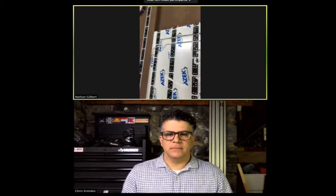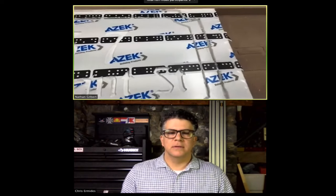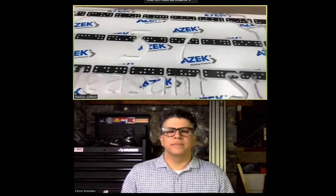The marking tape is laid out on the workpiece — it's PVC trim board with the guard still on so the router won't scratch the surface. You lay the tape out, then create a workspace by moving the router back and forth. That gets input into the computer, which creates a picture of what you're cutting on. Then you bring your file and position it where you want and drop it right there.